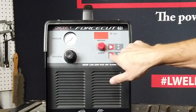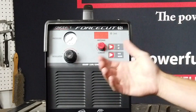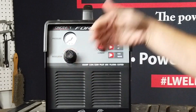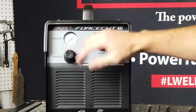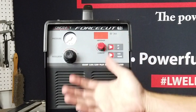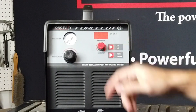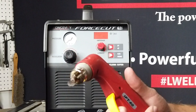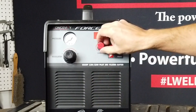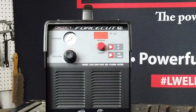You have a gas test or air test, which will purge air and allow you to see if you're having an air function issue with the machine. You can regulate your PSI by popping out the regulator. If you're running 100 PSI to the machine, you'd push it down to 70 or 80 PSI on the pressure gauge, or whatever is recommended for your cut. Then you set your amperage, and you have 2T and 4T function to regulate the different trigger types. You can adjust your amperage from 20 to 60 amps.